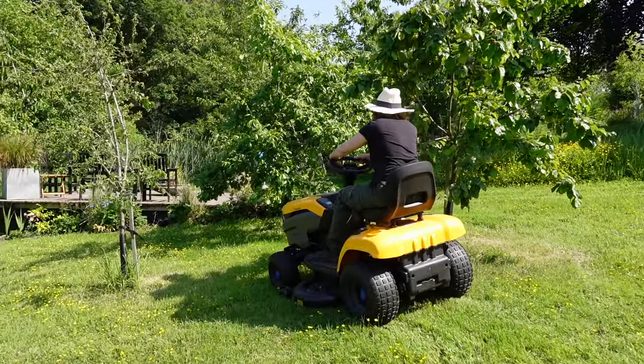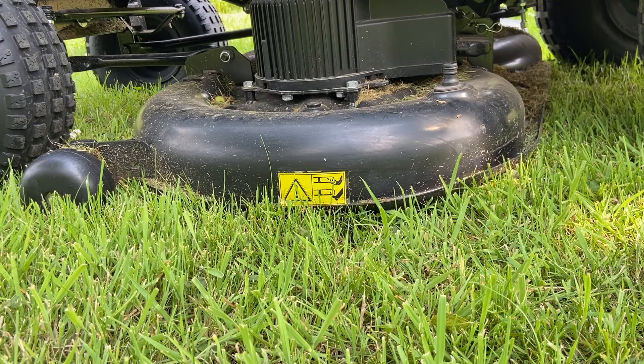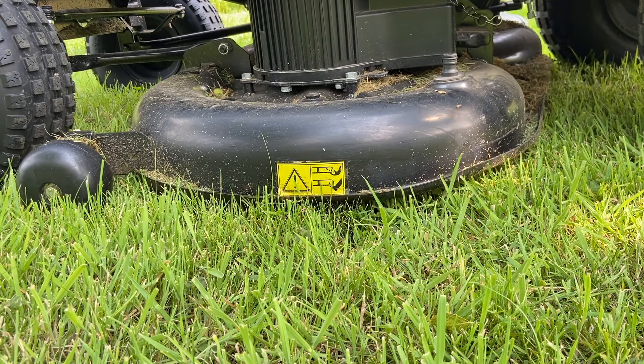According to Stiga, this is the first all-electric ride-on tractor on the market, meaning there are no more levers. To drop the cutting deck, it's all done on the control panel — really quick to do. You can change cutting heights while driving. If you're getting to a point where the grass is longer or shorter, you can adjust by just pushing a button. It's quite responsive — takes about five seconds to react to drop or pick up the cutting deck.